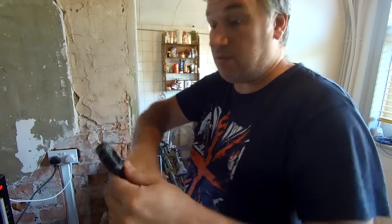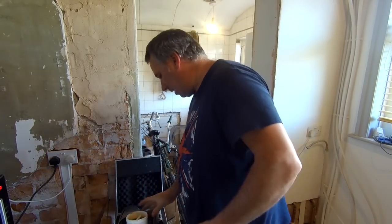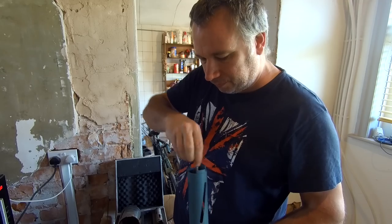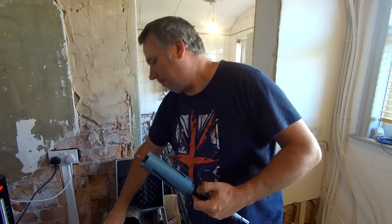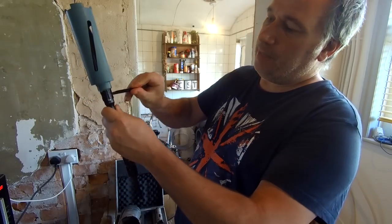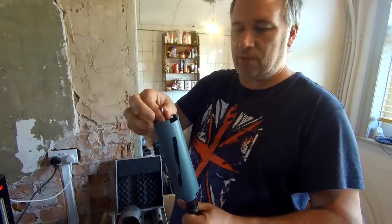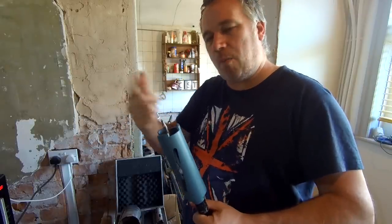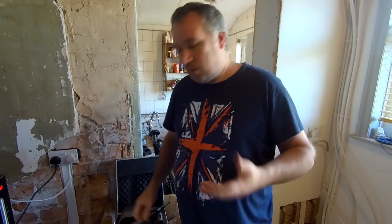They'll tighten up as it spins when you drill the hole anyway. So we're going to take our 52mm, get that in there, then we can take our pilot end piece - it just drops down inside of there. To get it out you've got these holes at the end - I think this is called a drift - just an angled piece that you basically punch in there and it'll push the drill bit out. You only leave that in there when you're starting the hole off; once your teeth have bitten into the wall and made a part circle, you can then take this out. It's just to keep it centred and help you.